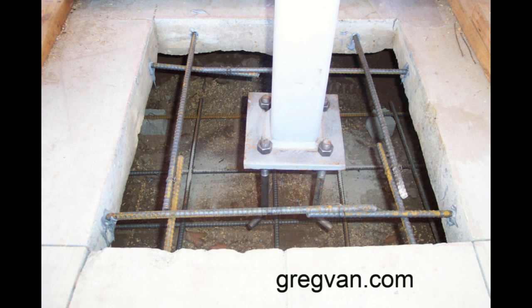This application can also apply to other sections of your home. One time I did a plumbing job where we had to tear out sections of the slab — cut it so that we could put the plumbing in, the waste pipes. And I had to go and dowel all of the concrete, similar to this, to keep the floor from lifting. Because a lot of times when you remove soil from underneath the house in order to put pipes in, if you don't dowel it, you'll end up with the same problem — it will actually raise or lower over time.